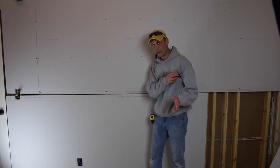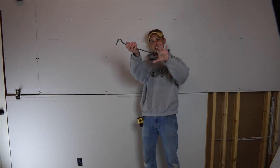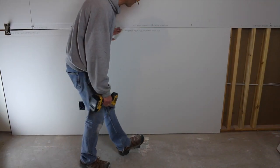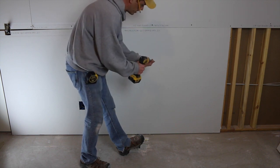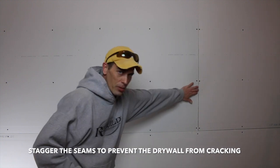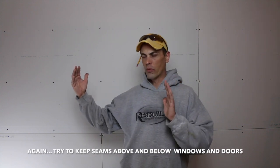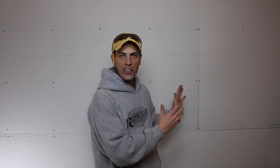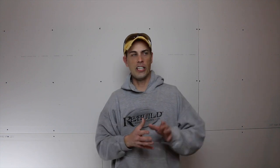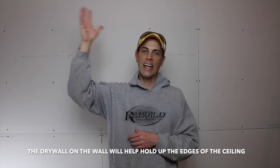We got the outlet and light switch cut out, they fit, but we still have a gap. This is where the pry bar comes in handy — you use that little curve to press down with your foot, hold it, and put the screw on. A couple of things I didn't mention: whenever you're doing a butt joint, stagger your butt joints from top to bottom. Whenever possible, try to break those above windows and doors. You always want to hang the ceiling first — it was just easier to film this video showing a wall application. Here's how to hang the ceiling using a lift.